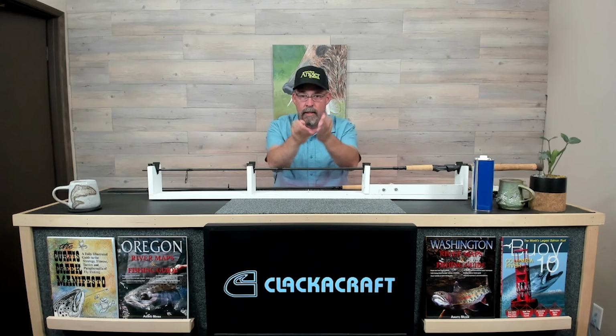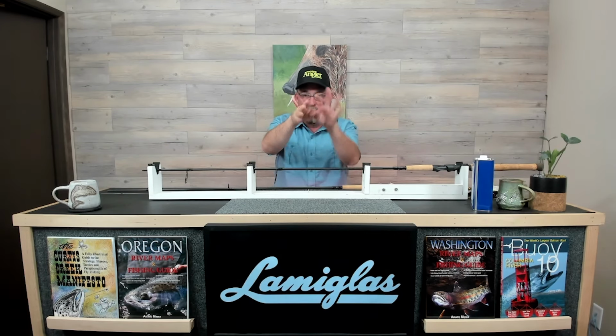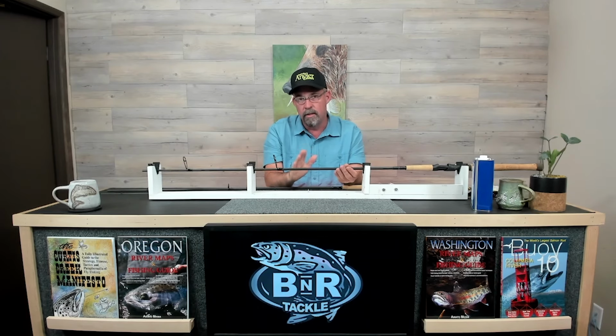And the reason for that is, I'm going to use my hands to show you. If you just go straight up and straight down, it's going to turn into this sag on each side, and it's going to get uneven on one side or the other and start making a weird spot. So if you rotate a quarter, it'll come down, and then rotate a quarter, and it'll come out more even all the way around the rod. But then when you get to the point where you can tell it's starting to slow down, I would finish off with straight up and straight down.